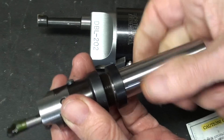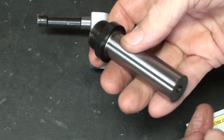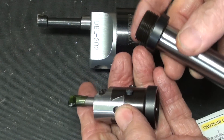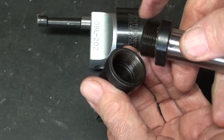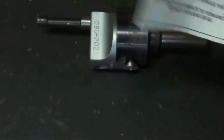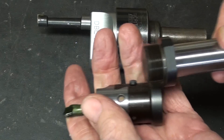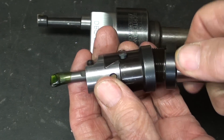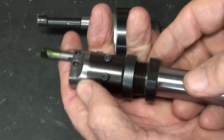This is also three-quarter inch in diameter, which looks like a little bit of overkill for this size, but I'm sure these are available in smaller sizes if needed — and this gives it a great deal of rigidity. Since this is threaded in, there's a very stern warning included saying: do not stop your milling machine quickly with the brake, because you'll spin it off. They suggest using Loctite to hold it on if you are in the habit of using the brake on your milling machine.